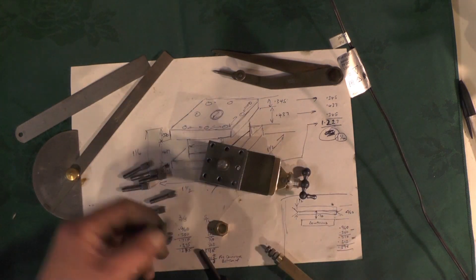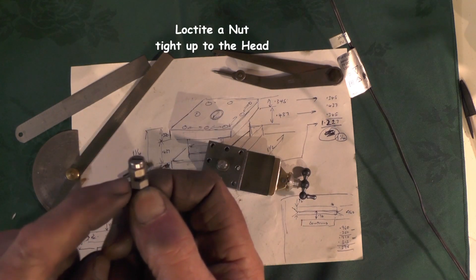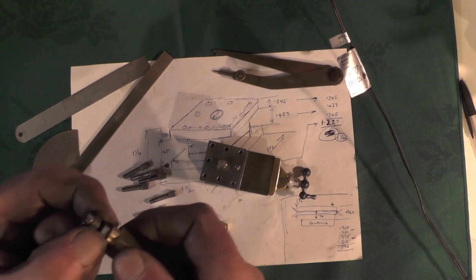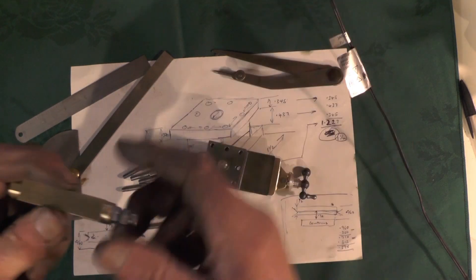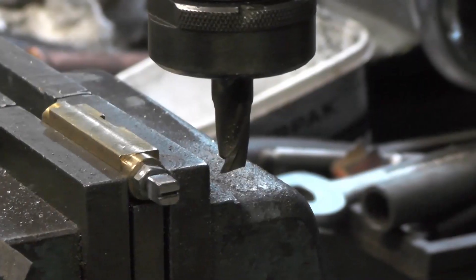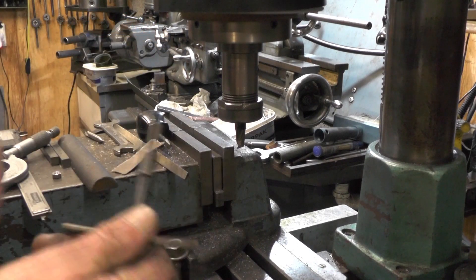For the actual studs, to save making them from scratch, I tightened the nut right up to the head, then made this little 4-position jig. Once I've got the stud into the jig, I lock it off with a lock nut to secure it, then I just milled my flat on — one side, two sides, three sides, four sides. And that's how they came out.